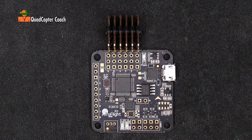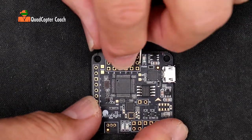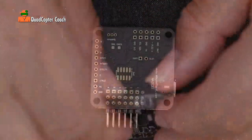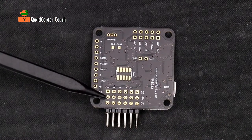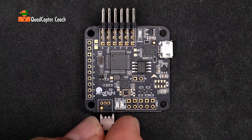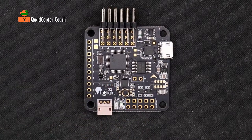At the beginning of this lesson we spoke about the header pins, which are going to be like training wheels on our first quadcopter build. They're going to be positioned right in these slots — they fit just like that. Flipping it over, we can see the pins popping out and we'll be applying solder to these later. The Spektrum radio connector will come right in there and will fit easily in those holes.